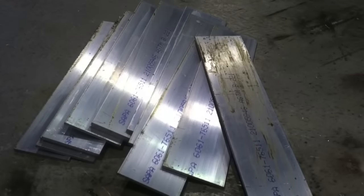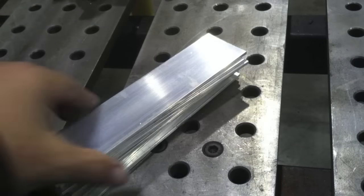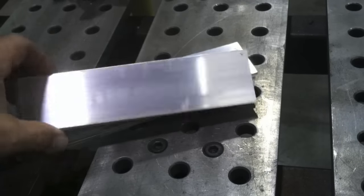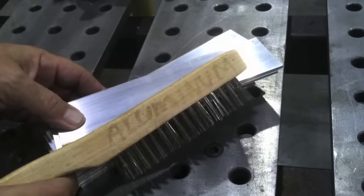The pieces are a little nasty. The first thing you want to do with aluminum before you put a wire brush on there — before you crap up your nice new stainless wire brush or put an abrasive on — is clean any gunk with acetone and a lint-free cloth or rag. Anything's better than nothing. Get them clean like that before you wire brush, sand, or however else you're going to clean them.